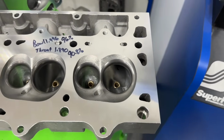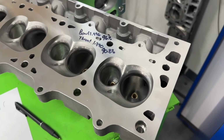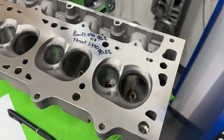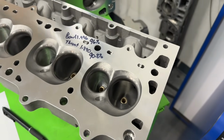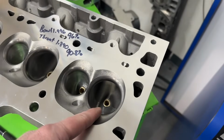So first thing I do is I look for the biggest valve I can shove in there, and that's what I try to put into it. But there's always exceptions. It's never 100%. So for instance, some circle track stuff, I would love to put a huge valve into some of them, but I don't because they're limited. Some of them are on stainless steel valves, and they're going to turn 8,500 RPM. Well, and some of them limit to the stem size too.